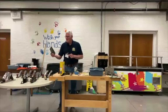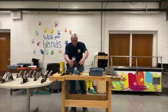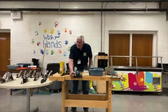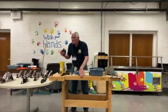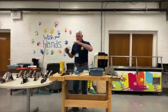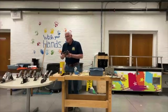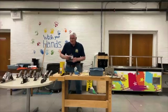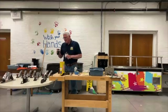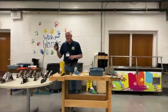Smokey, this one that you were just showing, the 78, what is it used for? Not that one, the one that you showed before. This one. That's how you would use it. The blade is not out. The blade would come down, and depending on how thick, if you wanted to put a flat spot on here, a lot of tables would have increments of curves around it. That's kind of what they would use it for. You could make the curves different sizes depending upon how deep you set the blade. The more you use it, it'll keep digging, it'll go down. And this was a Stanley. I looked in the book for it, and this is a very early one, like 1890.